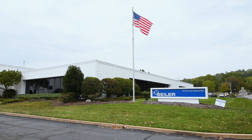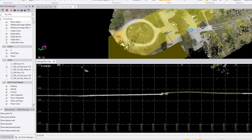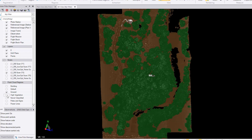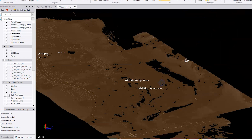So now we're back in the office. We're going to be taking a look at this data in Trimble Business Center. We flew both the L1 and the L2 at very similar settings. The only main difference was that the L2 has five returns and we're shooting at 240,000 points per second, whereas on this sample data set with the L1 we were using three returns at 160,000 points per second. My initial results show that the ability to get under tree canopy is substantially improved — we're seeing more points under there, fewer gaps. The accuracy and precision is quite a bit improved here as well.